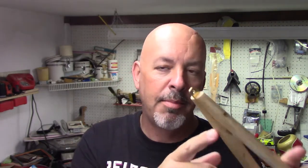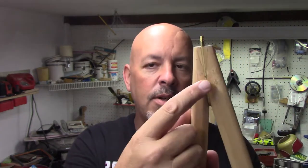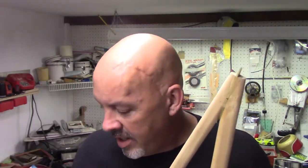What we're doing on the plane — I've got the wing struts apart. I've already put two coats of nitrate dope on and I'm going through the first sand. I'm kind of rough sanding it down first because there's little brass studs that go through, and then I've got little balsa pins meant to hold everything together. I'm sanding with 40 to 80 grit, down to some 120.